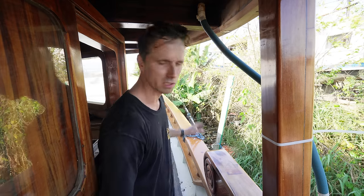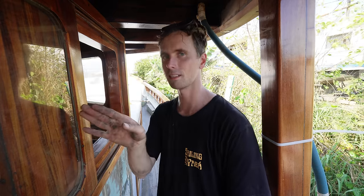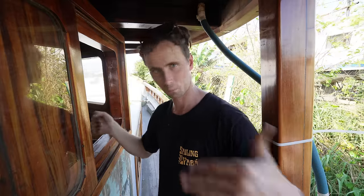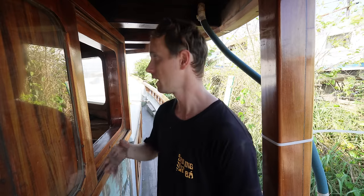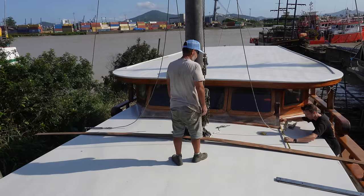from the mast to starboard and to port, where it would touch on the bulwark. So all we're doing with that is we've got a really long piece of wood, let's call it a batten, that we are holding against one side of the mast, like aft of the mast, figuring out how to make it perpendicular by using other parts of the boat as reference. Then we bring it to the other part of the mast, the forward part of the mast, and do the same thing. That literally gives us a nice drawing on the bulwark of where the mast is on both sides.